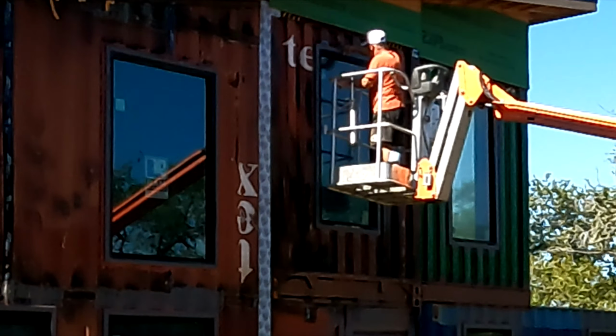Basically, I put all the sealant on. I don't really let it sit. It might be better if I do at least a few minutes, and then go over it with my thumb to smoothen it out on the frame. But the whole idea is to make a kind of concave form of the sealant. That's the required or expected way to apply it, not have a dome but have a concave seal that hits the frame and the window, the aluminum window part, appropriately, so the contact with the sealant is good.